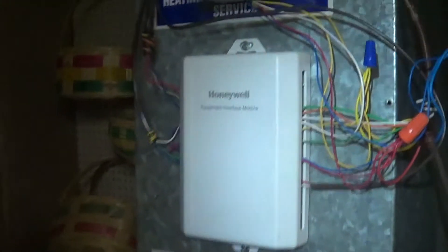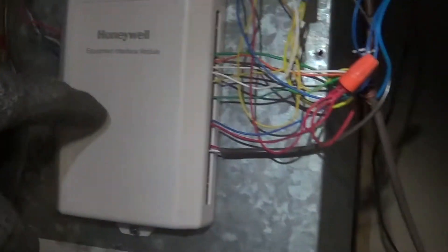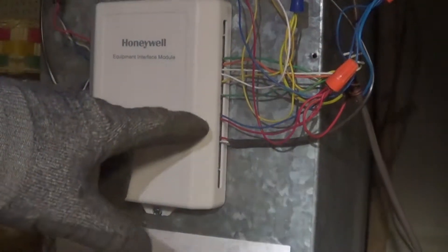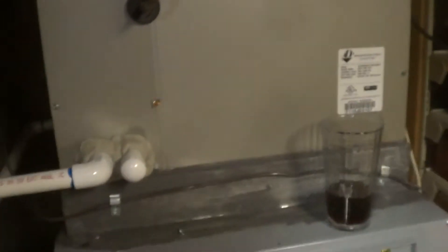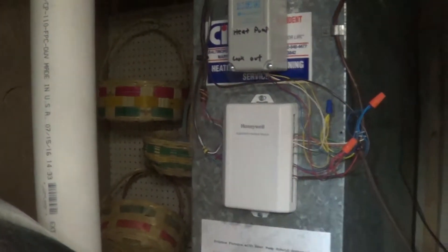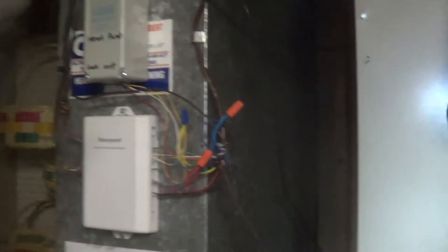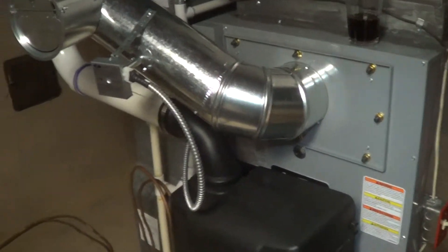Here's the thermostat control — a fancy multi-stage thermostat that can read outdoor air temperature. This is a much better method to control the heat pump hybrid rather than using balance point, because it's really hard to get the balance point right between the switchover between heat pump and oil or auxiliary heat. Setting it up as a regular electric with two-stage means as soon as it calls for second stage, oil is going to come on and it'll figure out itself exactly where it needs to run.